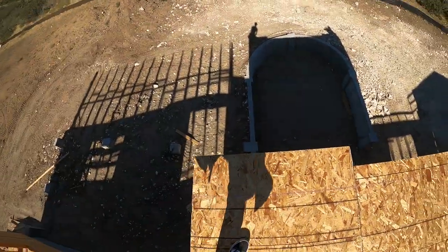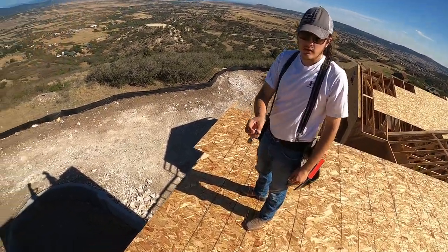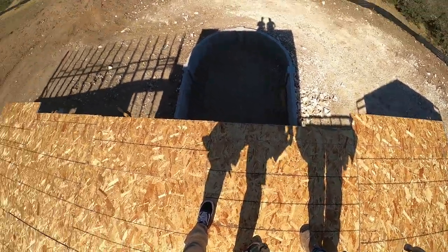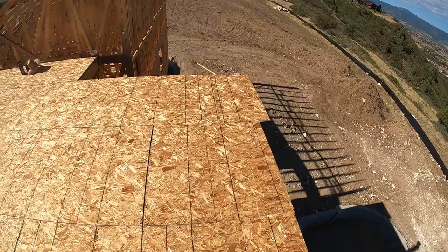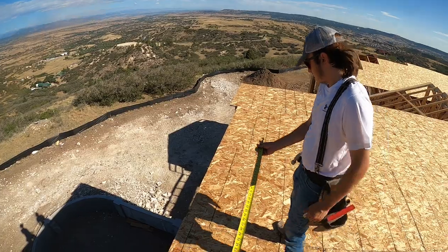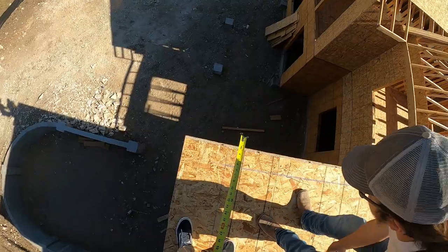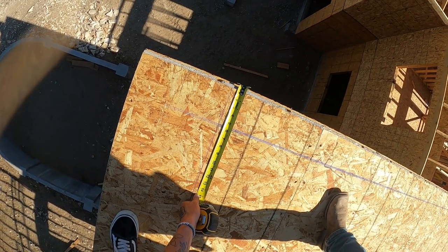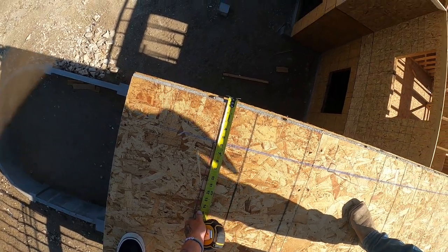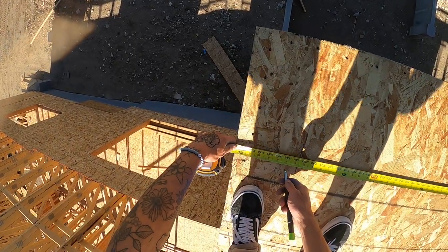So the red line is now our line — that's why I do red and blue. The red is permanent; the blue is not even close to permanent. The blue will wash away, the red will be here forever because this stuff works really freaking good. Do me a favor and burn me five and a half on the blue line. So if I say he's burning me five and a half, that means he's holding the tape at five and a half on the blue line, just like that.